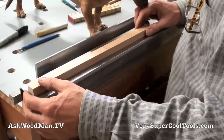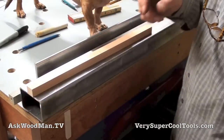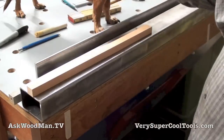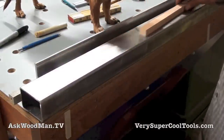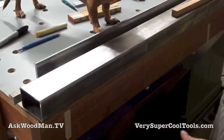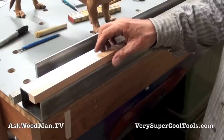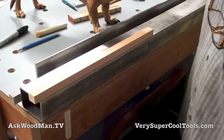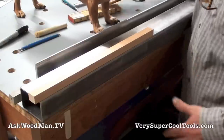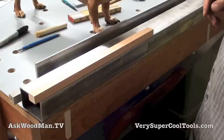This represents the Very Super Cool Tools T-Square, so it's 16 inches wide, and there is about where the fence is. Primarily I'm going to be cutting on this side because the router bit is spinning like this. But there may be times where I want to bring the fence all the way over to cut some slots in some panels, or bring the fence on this side of the unit so I have the support of the entire table to run a very large panel up against the router bit.